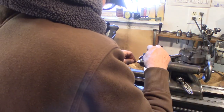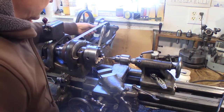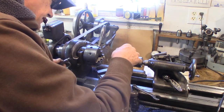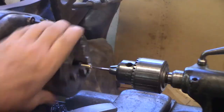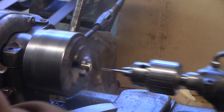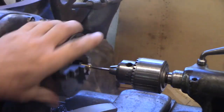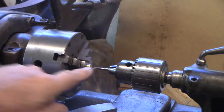Back to the job at hand. I'm going to tap this brass piston, and I'm not going to use the power so I don't accidentally bump it — I'm going to unplug it and use the belt. I always use a little air to keep everything clean, and just a drop of Tap Magic cutting fluid on there. I can disengage the belt and do this by hand, and run it backwards to pull it out. I'm getting close to the bottom and I want to feel it — I don't want to break that tap off in there. You can see that tap twisting. So I'm done.